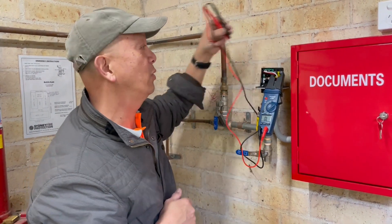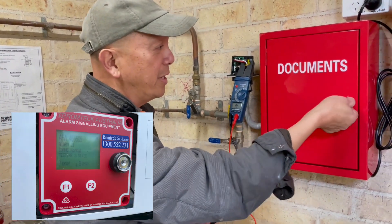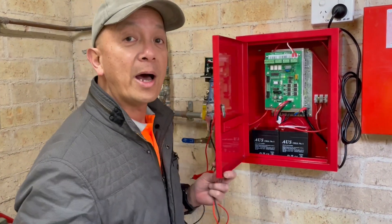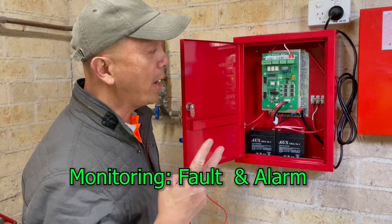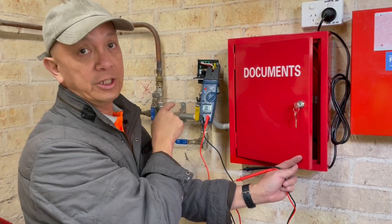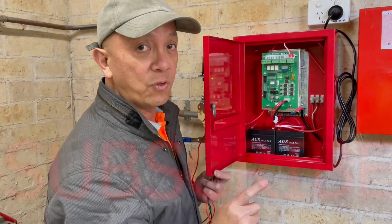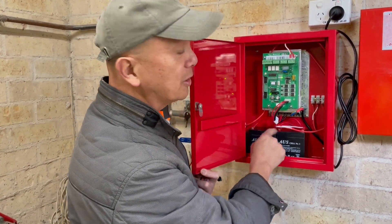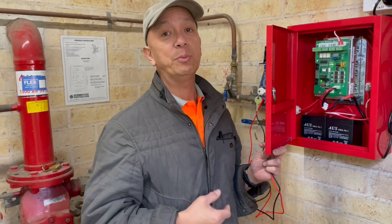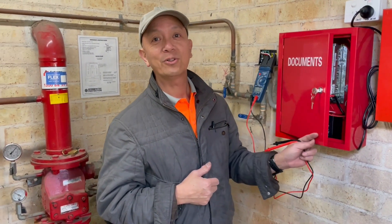That's how it works. Next time when the technician for the alarm signaling equipment installs his box, I will connect here and make a note that everything is tested and okay according to what is required. The alarm monitoring company will monitor two things: a battery fault or power supply fault, plus the alarm in the system. That's why I got this specific power supply — not just a normal power supply. This power supply monitors battery fault, power supply fault, and also charges the battery at the same time. I hope you learned something today. All sprinkler systems must be connected to the fire brigade according to Australian Standard 2118. This is Elmer again, your fire protection guy — see you next time.